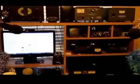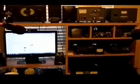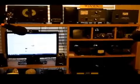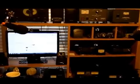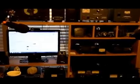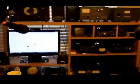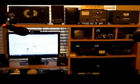Of course, we're back here in the shack, and just to show you, there's that window, and you remember right on the other side of that window is that ground rod that I showed you just a second ago, and that's about how far the ground runs. It's just straight outside that window. So I tried to keep the rule, you know, short ground as straight as possible.